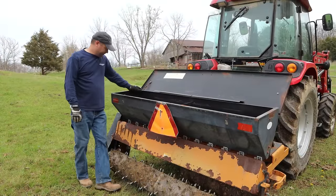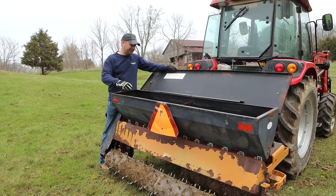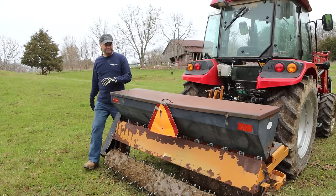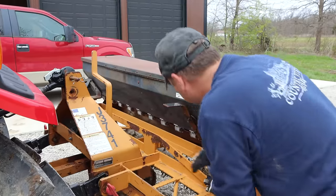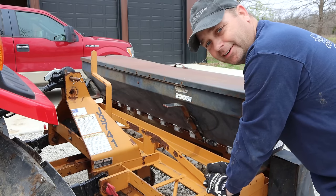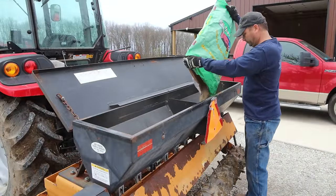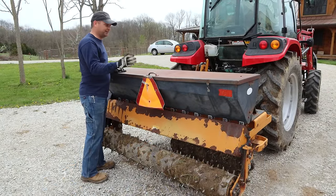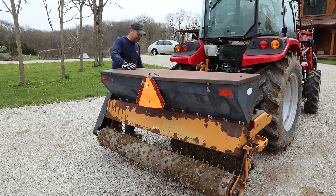It's empty. We've run all the seed on the ground already and we aren't even a quarter of the way through. It's dropping seed too fast. We've got to take it back to the barn and somehow get this adjustment to work so we can drop a lot less seed. I got it to move — I couldn't get it to move earlier, it must have freed up. I had rented a drill the first time I planted the hayfield and couldn't get enough grass seed to go down, had to go over it three times. This is the total opposite — it's dropping way too quick. Hopefully we've got it adjusted where we can do the whole pasture now.